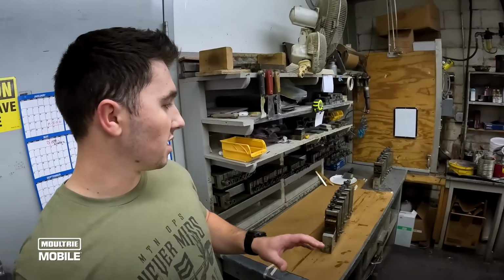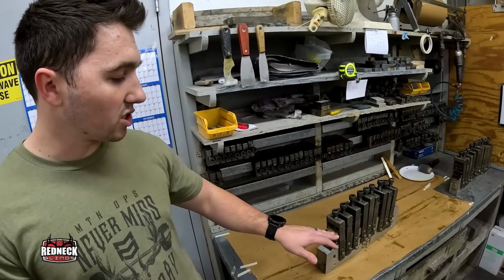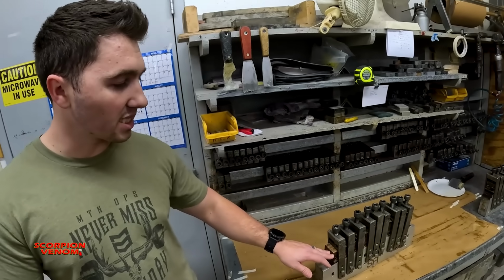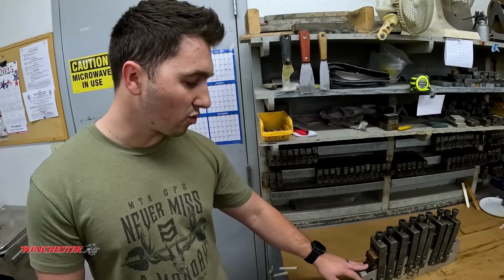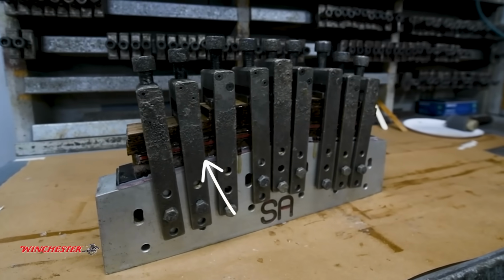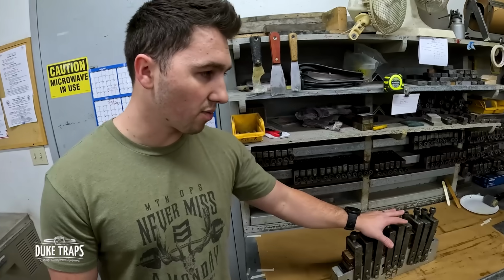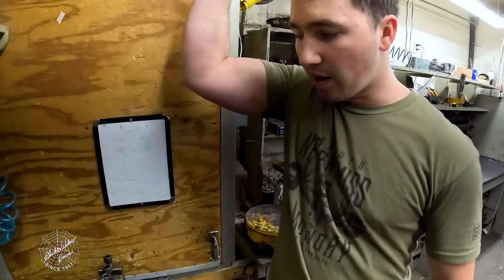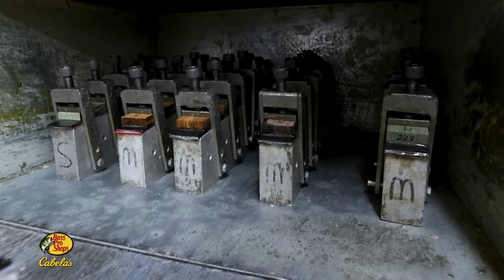So this is kind of where it all begins. We get this wood to come in, and this is all cut into boards. We'll layer it up with the glass that it needs, and then we're going to glue every side of every single piece. We're going to put it on these forms. These forms are dedicated to each model, and then we're going to put these clamps on it and clamp it down. We're going to slide all of this into an oven that sits at about 140 degrees. So these are some lowers that have come out, and we'll round those.